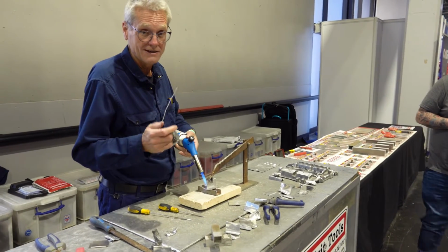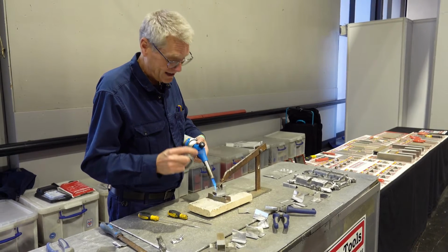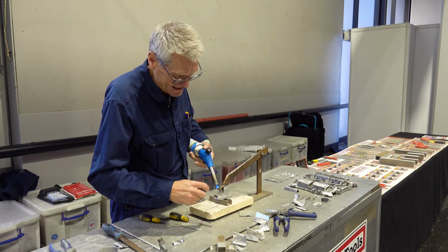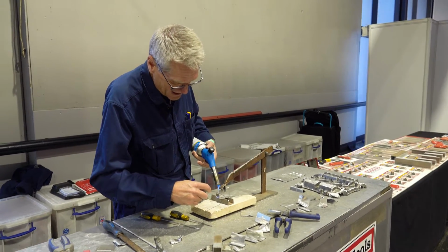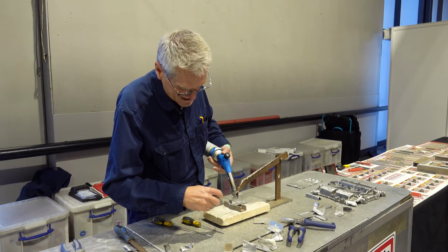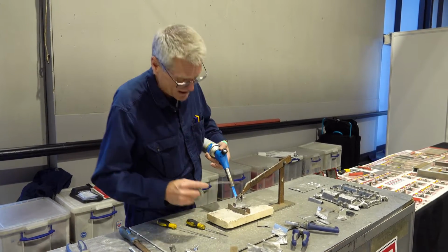So what goes on here with the wire is it's going to change the melting point for you. Only 380 degrees can weld together the materials here. Anything with aluminium, anything with zinc, anything with magnesium. And when it starts to melt for you here on this side, only use one big drop of it. You can do 30 times longer than its own length, the wire itself.